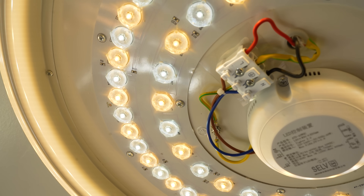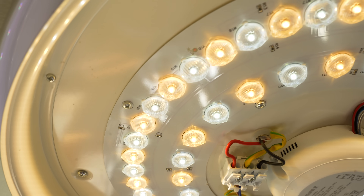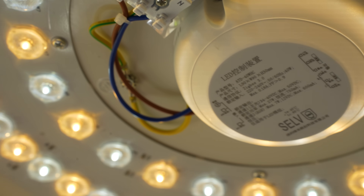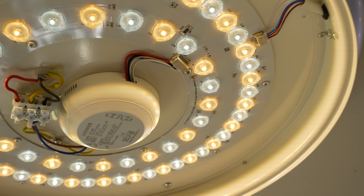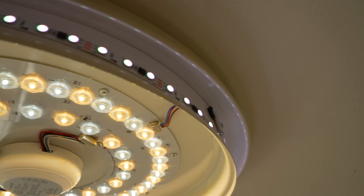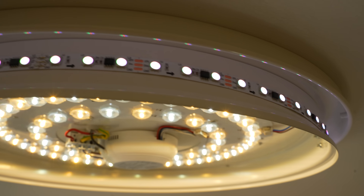It's actually super simple inside and consists of the power supply in the centre where you feed your mains wire into these push connectors — and yes it does require a neutral wire — and then that feeds into the main PCB which consists of a bunch of big LEDs which are white only but are colour temperature controlled, so you can go from cool white to warm white, and then that passes through via a connector to just a regular LED strip running around the outside of the dome. Extremely simple yet effective.